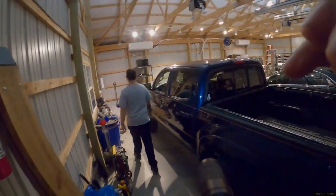And then I'm gonna turn on the air compressor. And that's going to draw however many amps that is. And we're going to see if it pops the circuit in the basement, because it won't pop the 100 amp circuit that's in the box. So 60 amp circuit there, feeding 100 amp breaker box with 100 amp circuit breaker. And then individual 30 amp circuits, and then 15s and 20s for tools. So it's going to be fun.